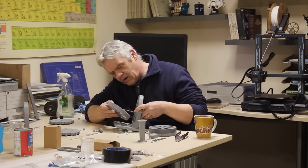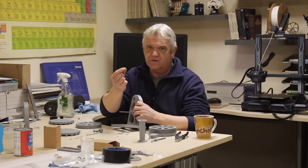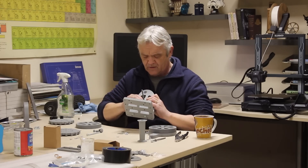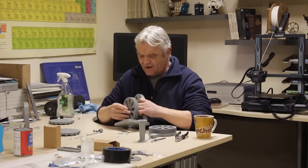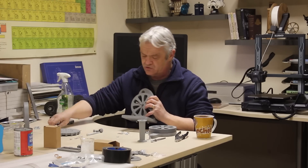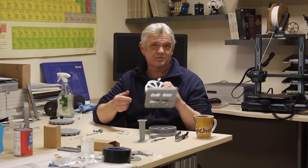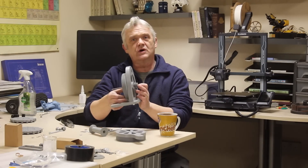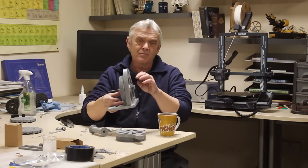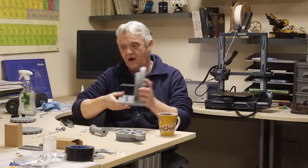This second cog will fit on there, but again it needs another spacer — this time the tiny smaller-size spacer. That goes in first, then the cog goes on. The cog has a hex recess that takes yet another nut. We put the nut on, tighten it down, put the cog up, and use the cog to spin it tight. You want to use a lock nut on it. So to summarise: small gear, 130mm threaded bar, medium spacer through the bearing, small spacer, then the cog held on with a lock nut engaging the hex.